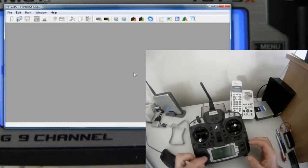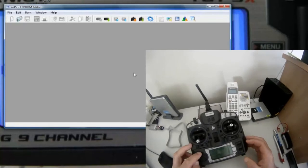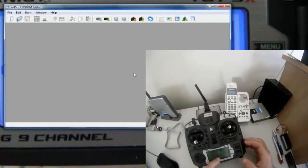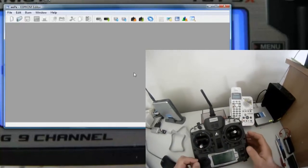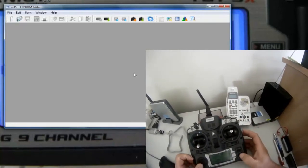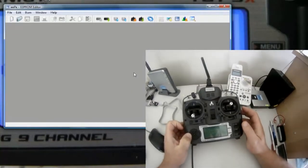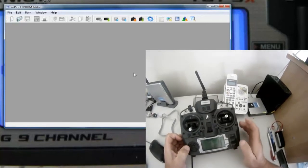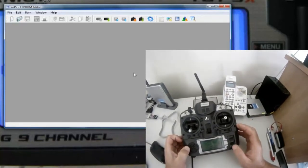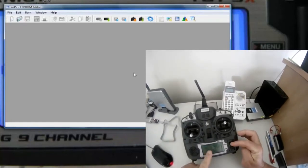Okay, so press any key to continue, and if I have a look here, see these lines are all way over, that means that all my sticks are out of calibration. So that's easy to fix. You hold down the plus button, and then you get to the main control menus of the actual radio itself, and you go to number 6, so back one to number 6, so press menu to start your calibrations.